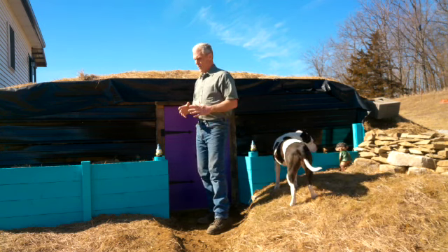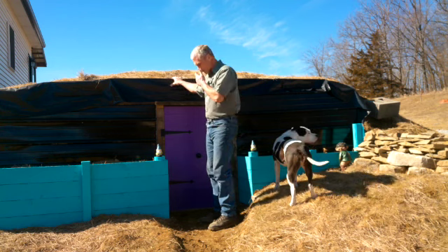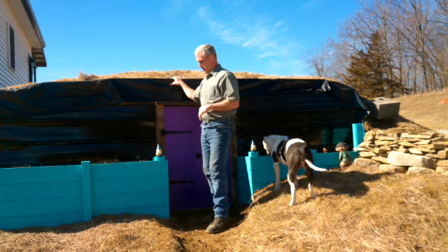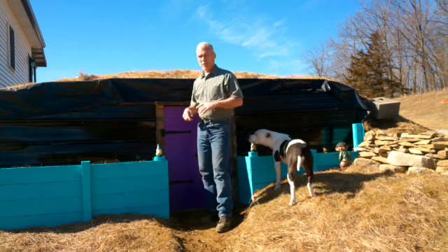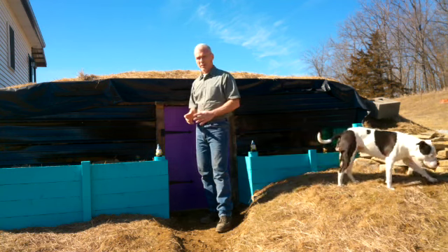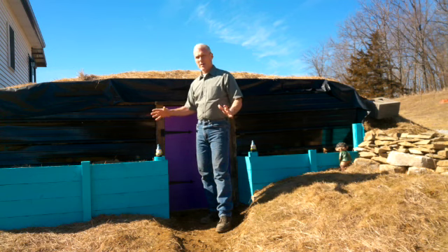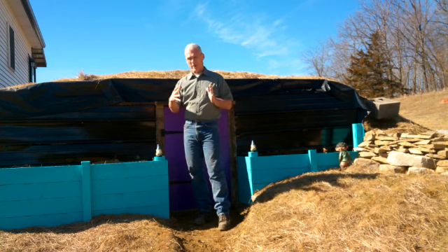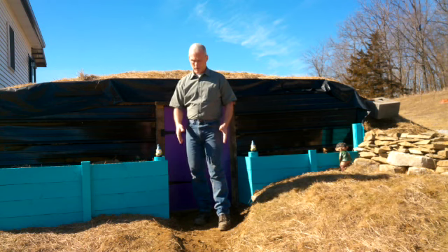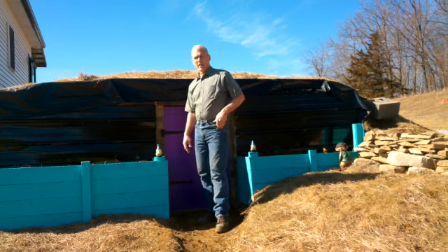What dirt was left over after we filled all the bags is what went on the roof. The hole is 8 feet deep, and after he dug the hole, we went around the inside of the hole, dug a trench, and then we let schedule 40 PVC in there for drainage, used landscape fabric, and then clean gravel. So if any water does get through wanting to make its way into the root cellar, it'll find the low spot — the trench — go through the schedule 40, out underneath the ground, underneath the driveway, and out into the pasture.